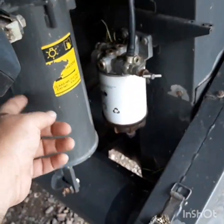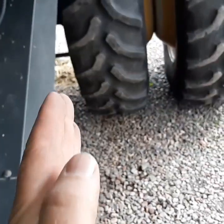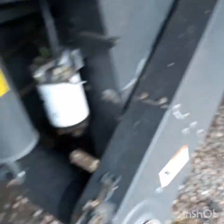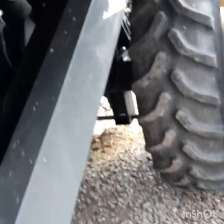This is for our 3D sieve — it's just a pendulum. So if the combine goes on a side hill, this hydraulic cylinder moves with valving inside, moving this bracket forward and backward, so instead of the shoe just going straight forward and back, the shoe starts to throw uphill as it moves. That's why the Lexions can handle a really steep hill and you don't see much side-hill loss. Nobody complains about side hills with the Lexions because of that shoe — it's a pretty slick system. I've really enjoyed this combine and learning my way through it. It has been an absolute treat.